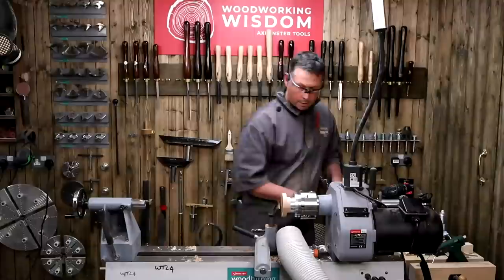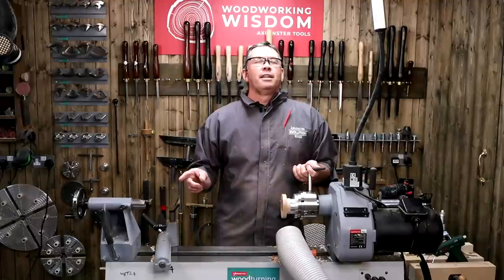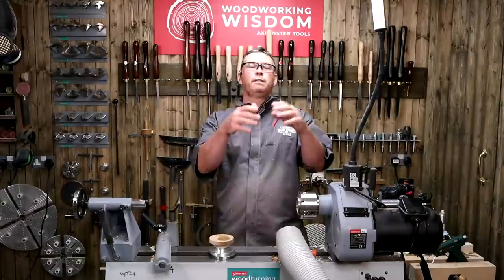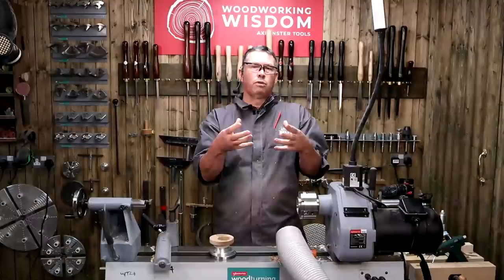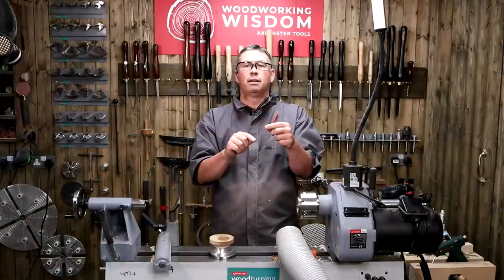Question: what's the difference between a normal Crown cryo and the David Ellsworth signature bowl gouge? David Ellsworth is a very well-known woodturner in the US — look him up, he does fantastic hollow forms and bowls. He has developed a grind with massively swept-back wings that fold right the way in toward the flute. The David Ellsworth grind will still be a cryo gouge, mimicking quarter-inch, three-eighth, half-inch, five-eighth gouges in the US, but it has this signature grind when you get it. The steel is the same — it's only the shape of the grind that's different.